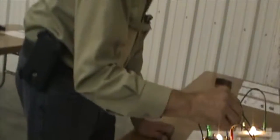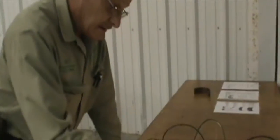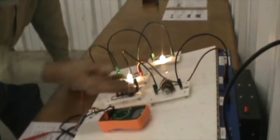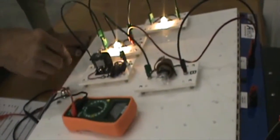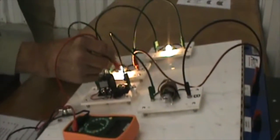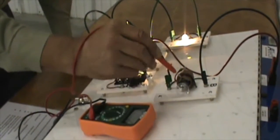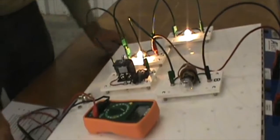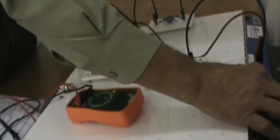The lamp on bulb B is not illuminated due to a bad fuse. We've already reviewed the reasons why this is not illuminated. Even though it is going through the fuse, you just don't have adequate current to be able to illuminate that element. Let us go to our next component board.